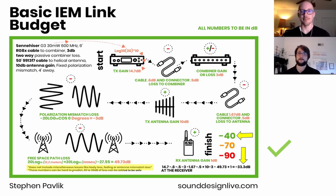Things that are hard to predict — like body loss and multipath fading — mean it's good to shoot high and understand we may have 20 to 30 dB of loss in the field. That puts us at a good spot because the real-world scenario will knock things down a bit, but we're still in a great area for the receiver. Factoring in that 3 dB of mismatch loss puts us at about negative 33 dB, which is still a very good area. So with this system and the artist 40 feet away, they're going to have great signal with no problems.